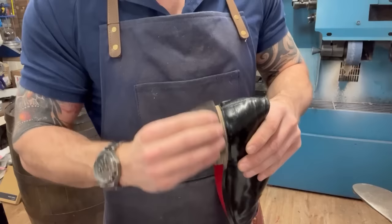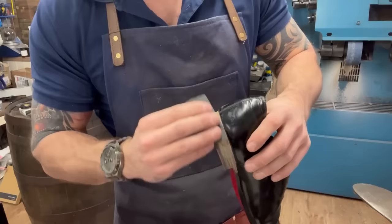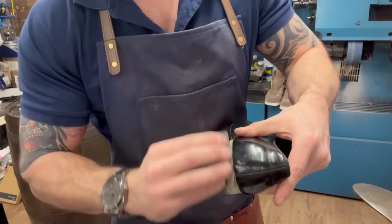What we do is finish off the edges, especially the heel blocks, with very fine sandpaper - this is 1500 grit. Even when you're really careful using the smooth belt sander, it can still leave some lines and marks. Using sandpaper we get rid of all those and get a nice smooth finish before we paint and polish it.